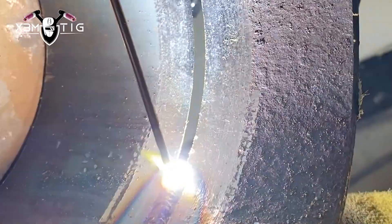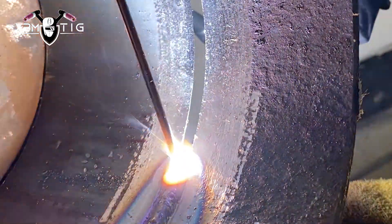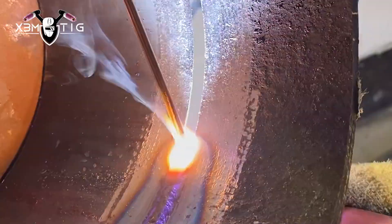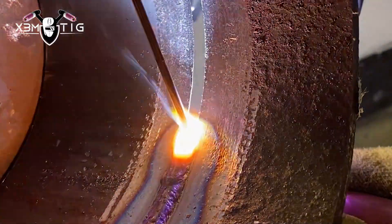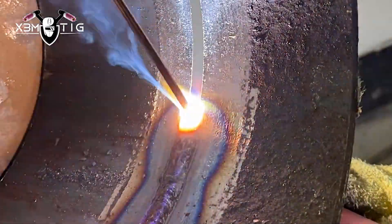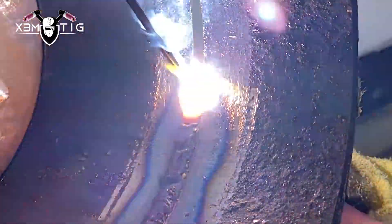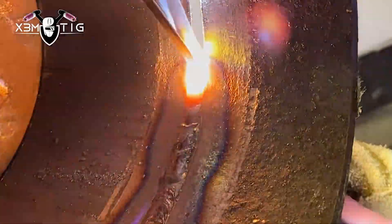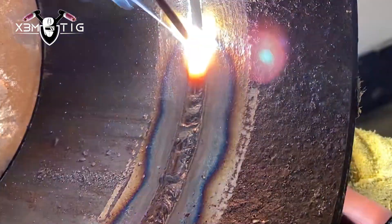On the side it's a little different than on the top — you want to keep that rod as far as you can before reaching that tack, then finish from the outside. Back feeding is definitely one of the skills you want to learn; it's going to help you a lot in the field. In the field we've got different shapes and sizes of gaps — not even, not perfect. We get wide, tight, three different things on one joint, tight spots and other obstacles. That's the beauty of our job, and that's why back feed is a technique you want to learn.